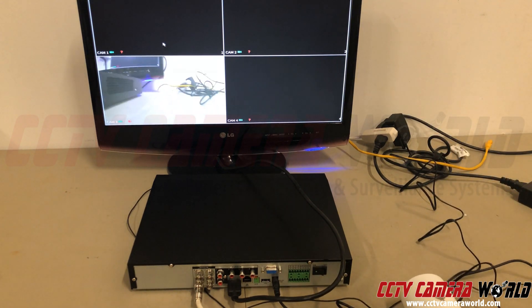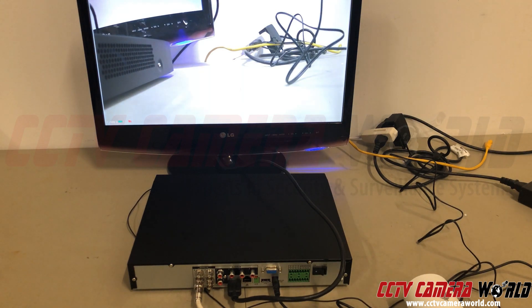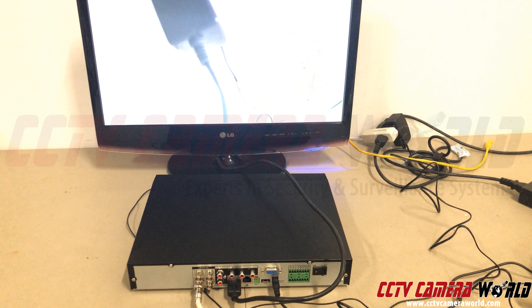If you're really into troubleshooting and you've got lines going through your video, you can test both day and night video. Good clear picture in the day, and when the lights go off the picture gets really bright because the camera's IR turns on. If you happen to be having lines on your cable connection where the camera is mounted, the issue is most likely in the cable, a grounding issue where it's mounted, or high voltage current near the camera. Eliminate all that by first dismounting the camera and doing this bench test.